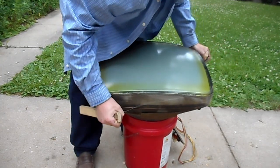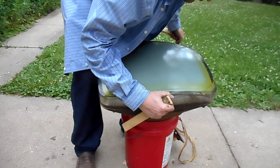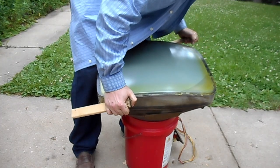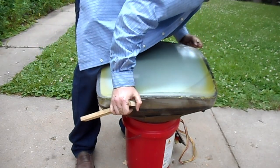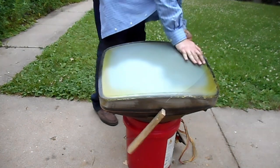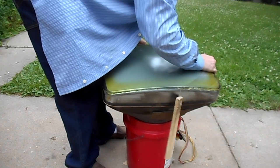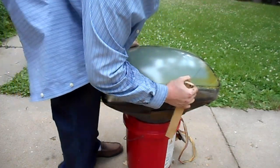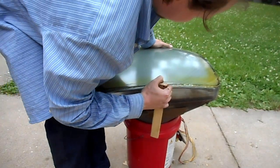This does require a bit of arm strength, and before you get started, you should really have some better safety gear than I do. I've done so many of these Zenith CRT cataract removals without any incident that I no longer have any fear of bodily harm to myself. However, you should probably take care while doing this, especially if this process is new to you. When doing RCA style cataract removals, it's a little bit more important because those tend to involve circumstances far more likely to cause implosion than what I'm doing now.